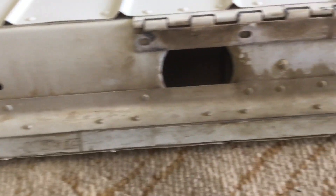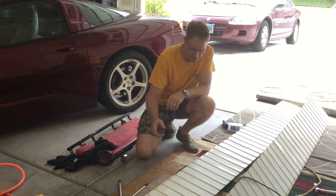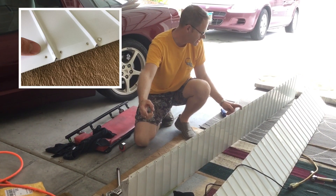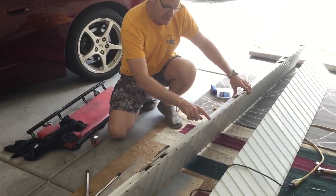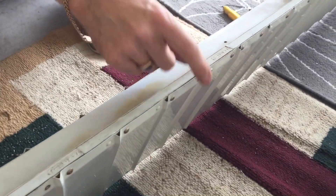I'm kind of behind on my updates to my This Old Airplane Facebook page, but that's how it's going. Stay tuned for more. So, one of the things we're doing here is we're replacing these balance weight rivets. Here's the aileron balance weight — it takes up almost half of the length of the aileron. There are the control rods right here, and that's the outboard edge. The balance weight is on the outboard edge.